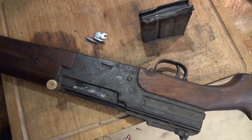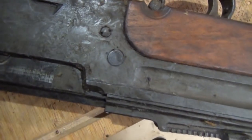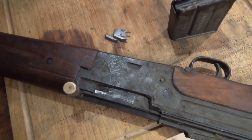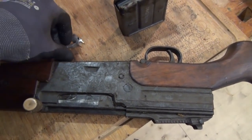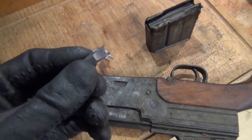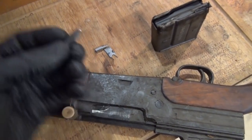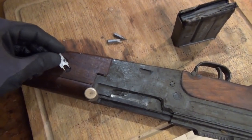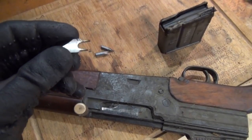Now, with regard to tooling, some of you may know that the French firearms are graced with these particular bizarre screw heads here. These are supposed to be tamper-proof so that Johnny Poilu does not disassemble bits of the gun that he shouldn't. So these have to be opened with basically some little custom tool bits. I just find some old screwdriver hex tool bits and just grind away until two prongs are left. Some of them are a bit wider than your standard tool bit, and for that, for example this one for this bolt here, I just used an old circular saw blade and cut out a little pronged key.